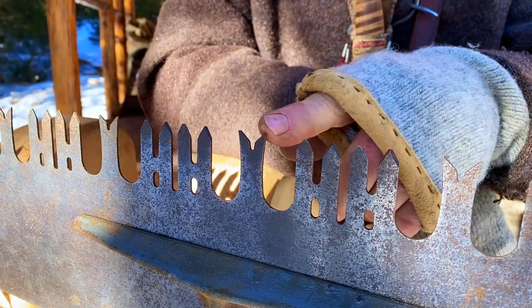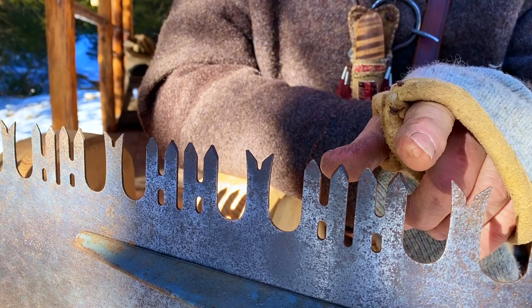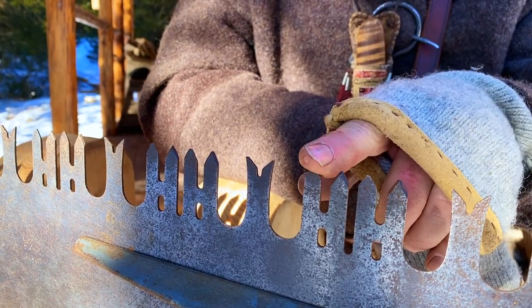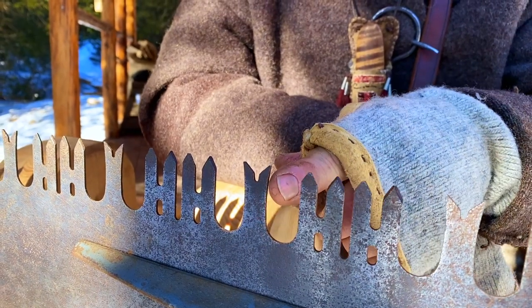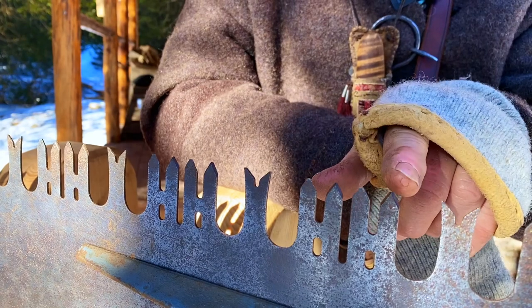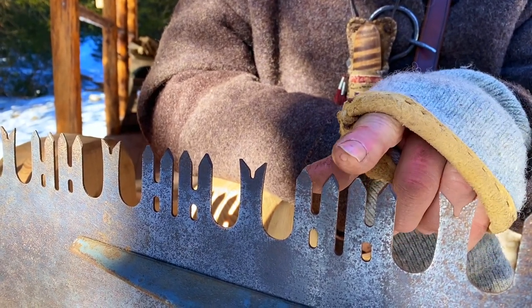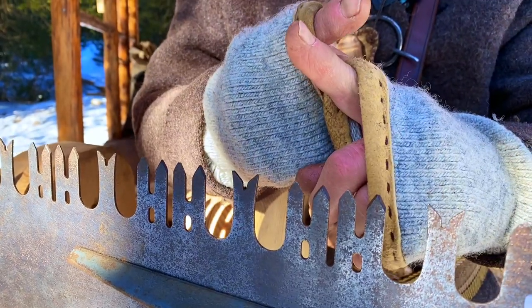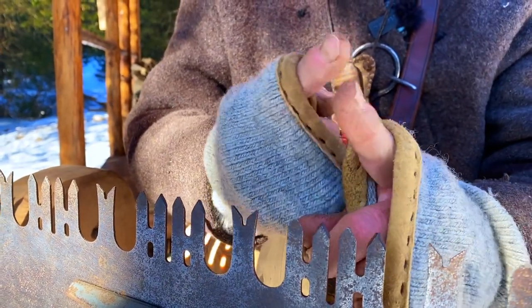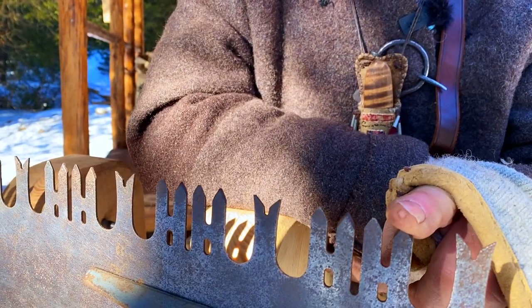So here we go with the parts of the saw. These are the cutting teeth, and there's groups of four, followed by what's known as a gullet, followed by what's called a raker. The purpose of these three particular things: the teeth cut the fiber, and they are set opposite. So one goes this way, one goes that way. There are 58 on this particular saw.